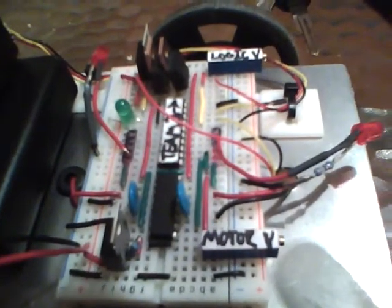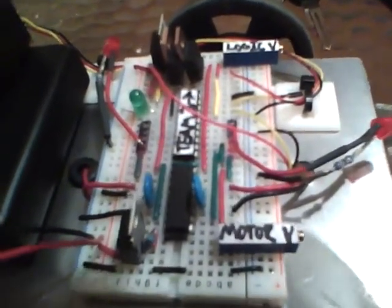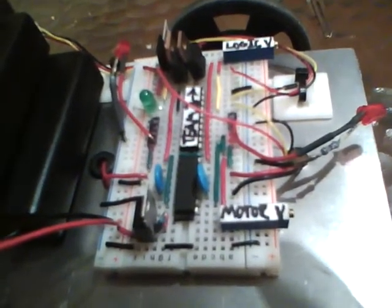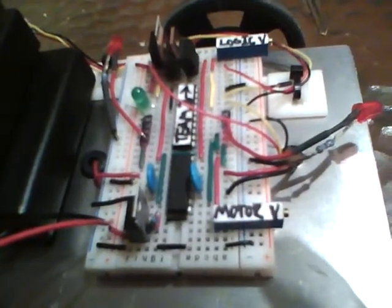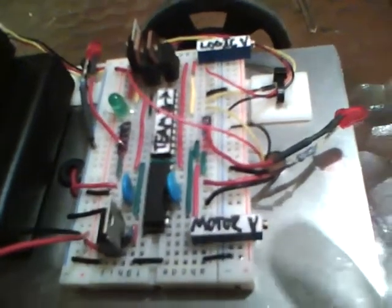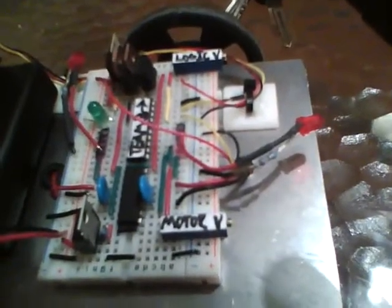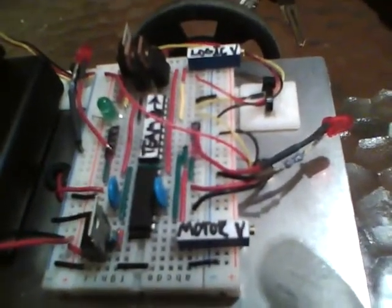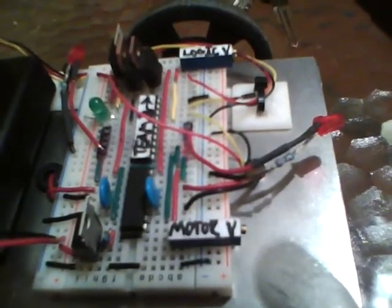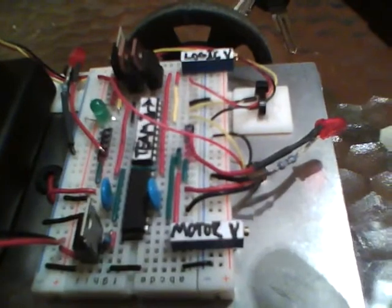Someone actually mentioned to me — and at the time it didn't really occur to me how valuable it was, but it's actually a really great idea — for people that are going to run off one battery pack: we're using 4AA and 2AA running to about 9 volts. What someone recommended is you can have your sensors read when your motors are off, and then turn your sensors off and have your motor go. Because you're turning your motors off when you read your sensors, you're not getting all that feedback from the motors — it's not distorting your signal. But if you're using bump sensors, this really isn't that important, because as long as it's above a certain voltage it's going to read that it's on.